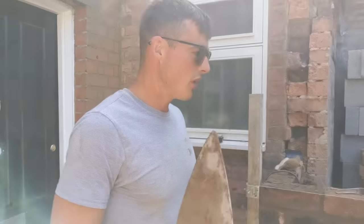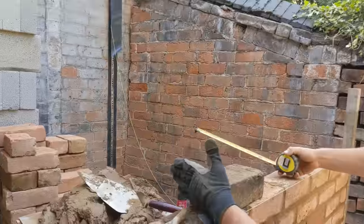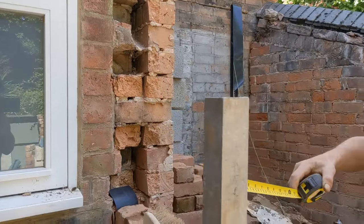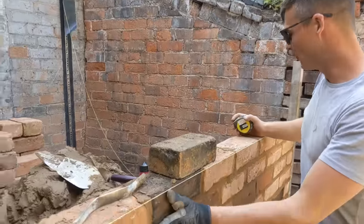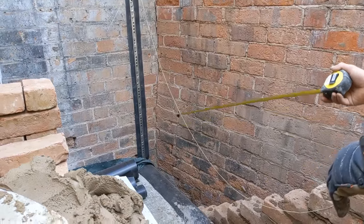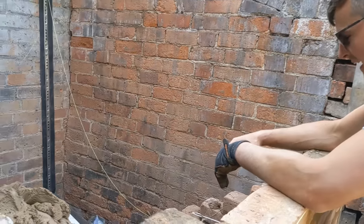We are up to windowsill height. I've set my window out — we haven't really got a drawing here so it's a bit make-it-up-as-you-go. I'm going to have a bath in here and my window sill is now set so there should be plenty of room. It's a privacy window, following the same sill height as next door. This window needs a steel because we've got glass here and glass there, so we need a steel post going up. Now I'm going to hop inside and build this little panel and figure out a way to tie that stop end into the existing wall.